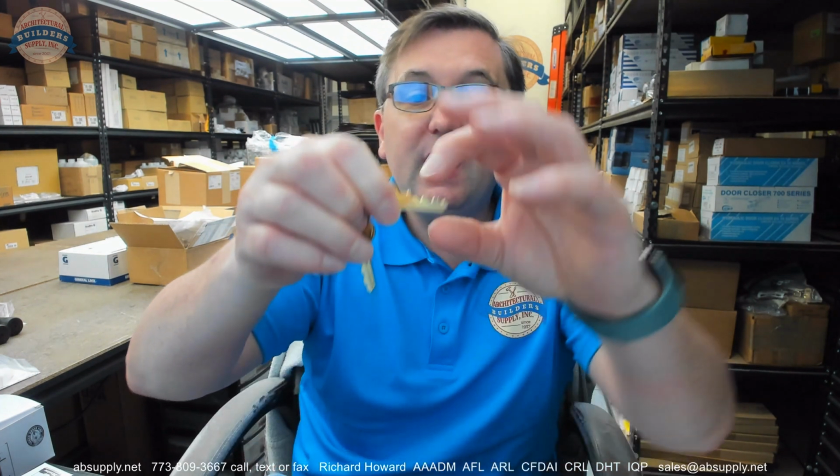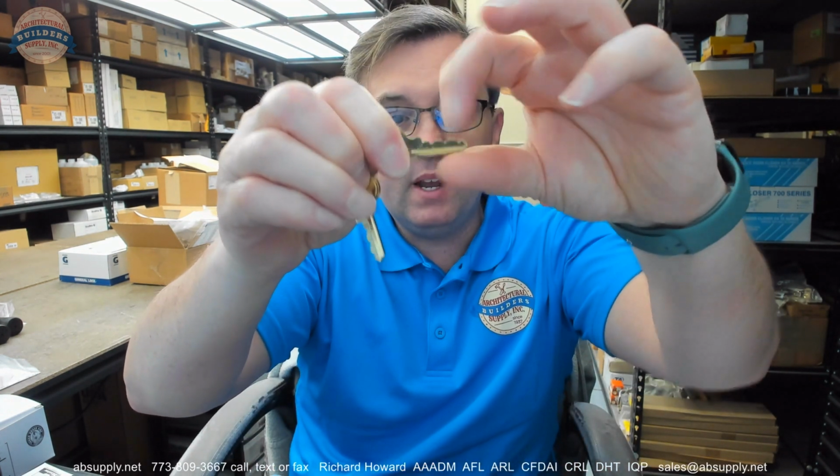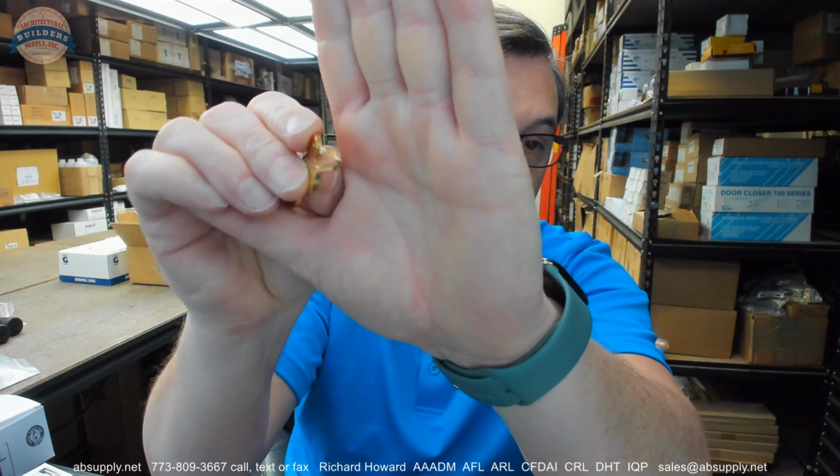So be mindful that you can not only tailor the padlock size, but you can tailor how they're keyed. You can tailor the key number, the bitting, the code, so to speak, of the bitting that passes into the cylinder, onto which you can tailor the profile of the broaching of the cylinder plug itself, the actual profile of the key blank. Okay, so a lot of options there.